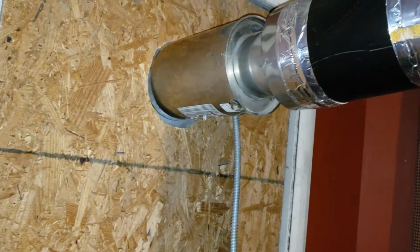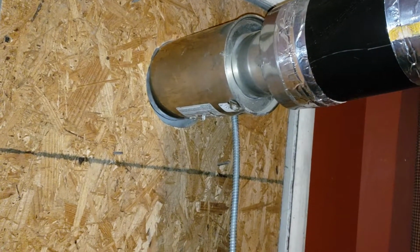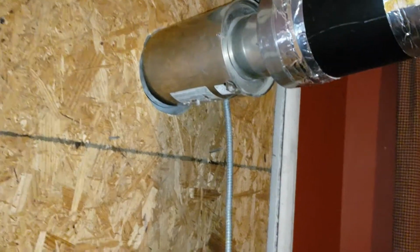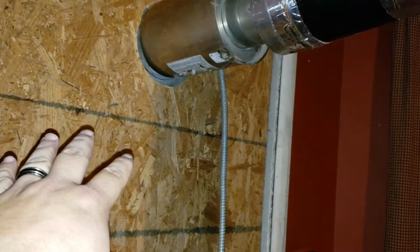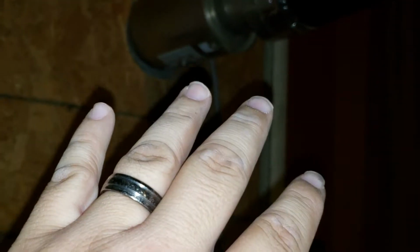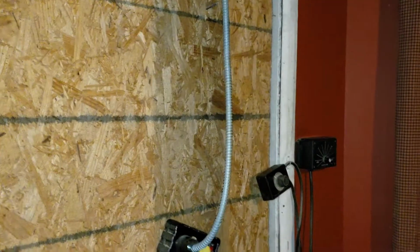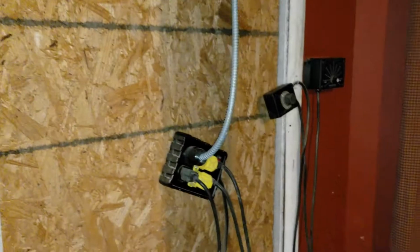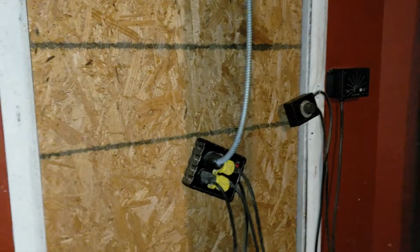Yeah, that right there was a really nice upgrade. So you don't need a full chimney. As long as you got a power vent to pull those gases out, try to face it away from the wind. That way it's not blowing into the wind and then just causing some kind of gas pocket around your house and seeping through your house and making you sick.